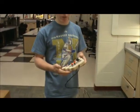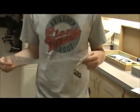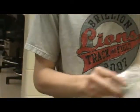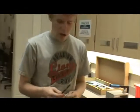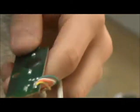Having limited buttons with our controllers, Evan decided to do some research on keyboards. After ripping apart a keyboard, we found out that all a keyboard is is a bunch of push-to-make buttons. After tearing out the membrane switches, I took a wire and went from each one of these black little leads and mapped it out on a piece of paper to be able to control tons of buttons.